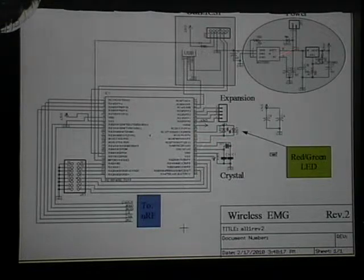On top over here, you've got the USB port and the power supply circuitry, which is over here. For the NRF, you have to use 3.3 volts. So even with a lithium-ion battery, the lithium-ion battery's voltage is 3.7, and that would burn out the chip since 3.3 is the maximum input voltage. So I used an LM117, I believe, which is the same pinout as the 317, to create my own voltage regulator to bring it down from 3.7 to 3.3.